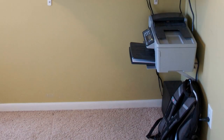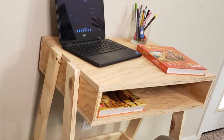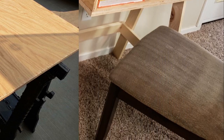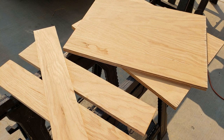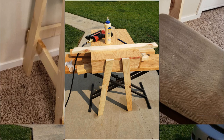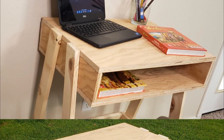Number 2: a DIY wooden desk for under $20. The finished product measures 24 inches wide by 18 inches deep — large enough for a student to work at rather than the kitchen table. Use a 2-by-4-by-three-quarter-inch piece of sanded plywood to make the box; this size is widely available at retailers. Cut two 18-by-24-inch pieces for the box's top and bottom. The dimensions of the sides are one 24-inch by 4-inch piece for the back and two 4-inch by 17-and-a-quarter-inch pieces for the sides. Glue the sides and top and brad-nail them — this results in a box with one side open. Lightly sand the edges to round them off.